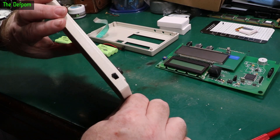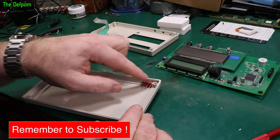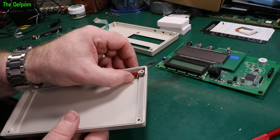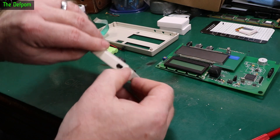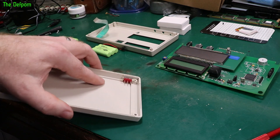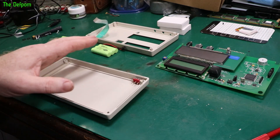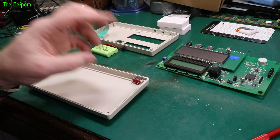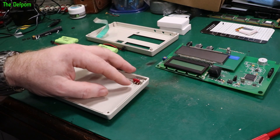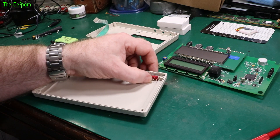So as the first stage of mounting the switch, I've cut the hole in and mounted the switch roughly in there. The plastic I've cut out of that hole I've remelted around the switch to help hold it in. Now this isn't actually held in properly — it's barely holding. But that's a good starting point because it's got some nice rigid plastic which is the same as the original stuff, which gets it wedged in the right place so it's not really going to move. Around this I'm going to use hot melt glue, or maybe I'll melt more plastic around it — I'd rather have plastic than hot melt glue because hot melt glue isn't wonderful for rigidity. That is basically holding in place already.